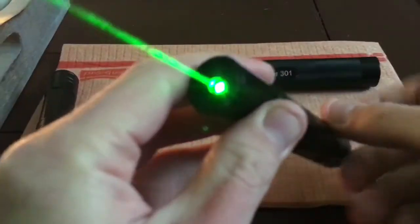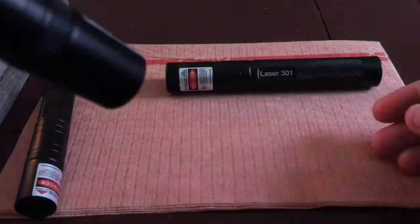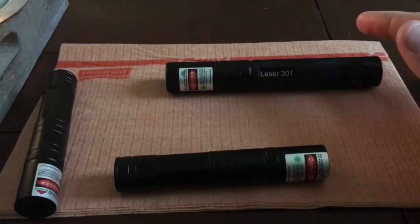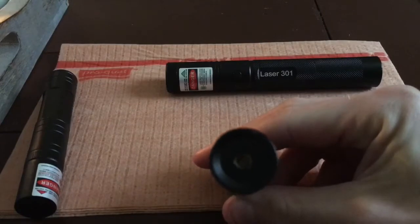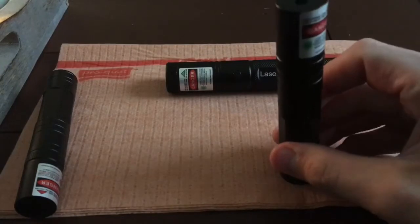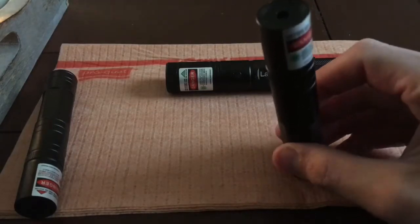Here is the 40mW 532 — or so-called 40mW, when in reality it's around 70 milliwatts. These particular lasers do not have an infrared filter, so keep that in mind. I have laser safety glasses that measure in ranges from 190nm to 540nm, and these two green wavelengths at 532nm are within that range and can be blocked out. But at an angle — never look directly into the laser, even wearing those glasses, because you may not be covered for that particular infrared wavelength. You can barely see a hint of red light, indicating no IR filter.